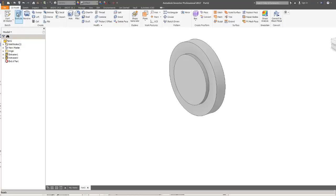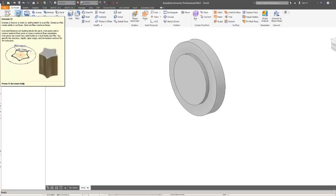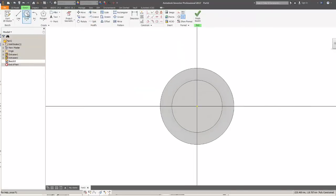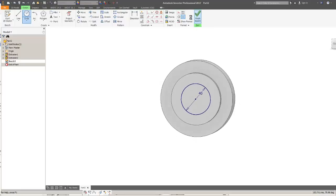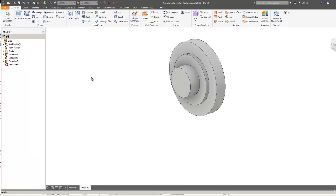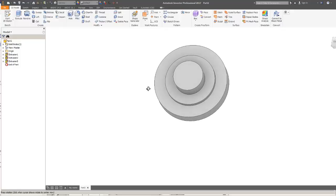There's one more circle that makes up the basic shape. I'll start to sketch on there — a circle with the same center as before, and this one has a diameter of 40. In terms of its extruded height, it goes to 36 millimeters total and we've already got 20 millimeters, so it's going to be 16 more. So that's what we're starting with.